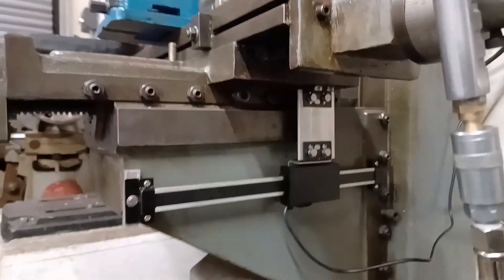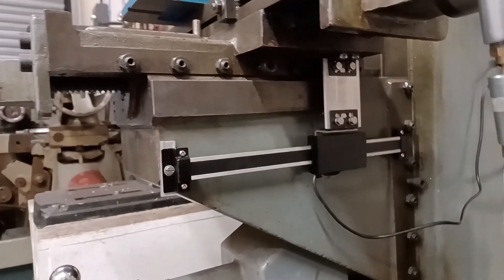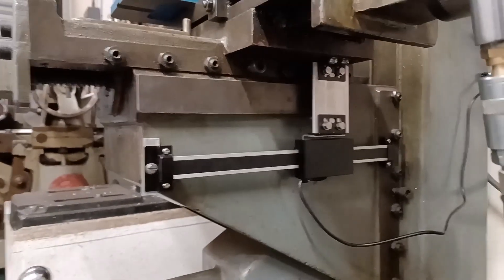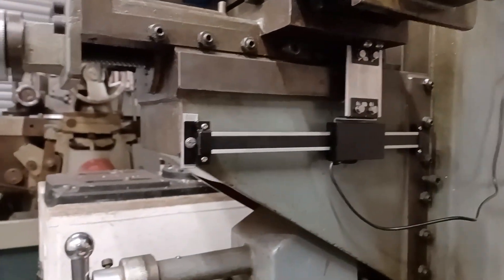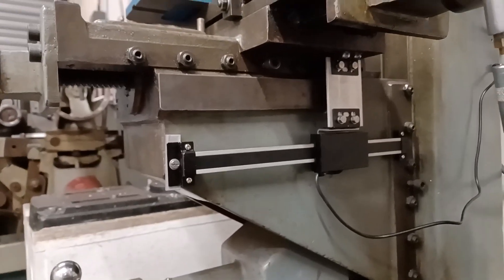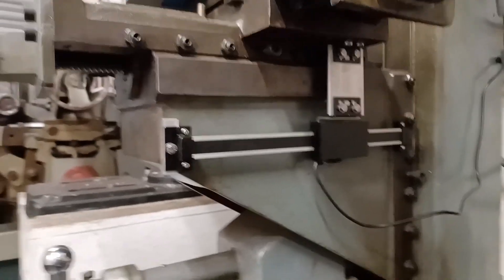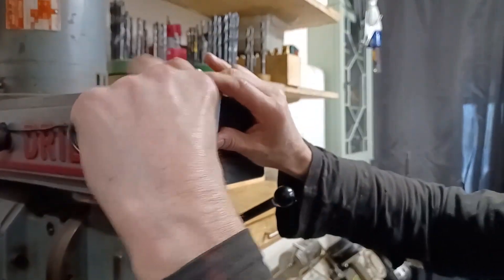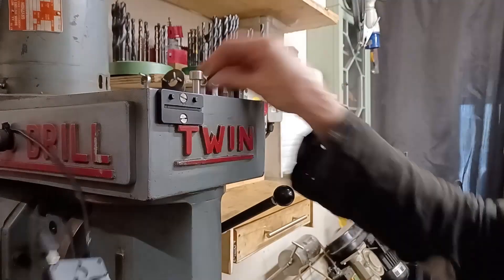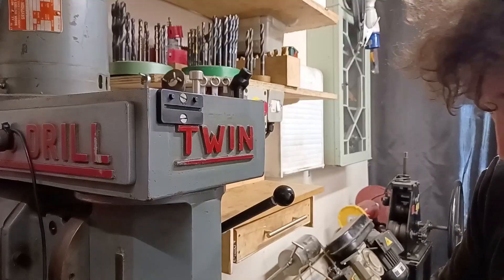You can see it's literally just one of those cheap ones from Amazon. The brackets it came with were all a bit hopeless, so I had to modify it all and make a stainless steel bracket for the back, and obviously drill and tap into the cast iron for the DRO scale. It took a lot longer than it should have done. It was really cheap - I think it cost about 30 quid. This is only one axis; I've got another axis coming which will be the Y-axis.